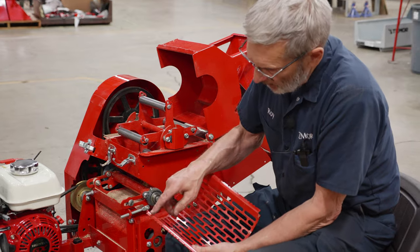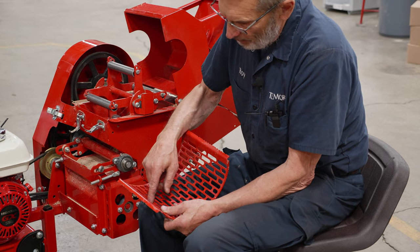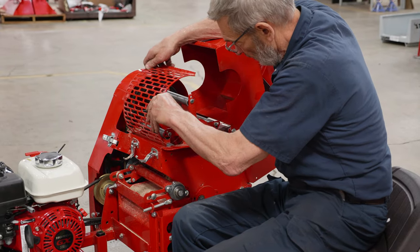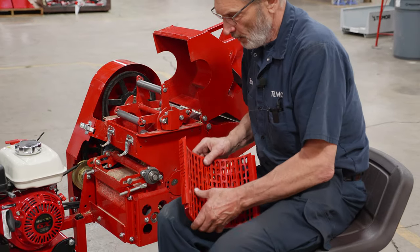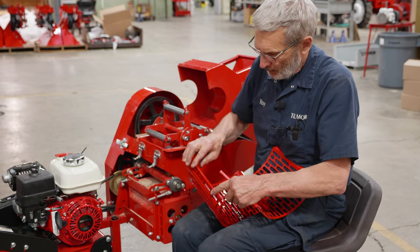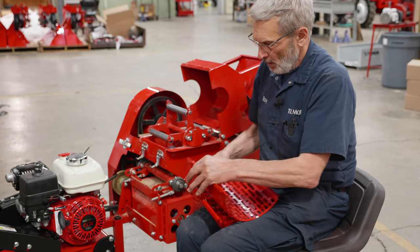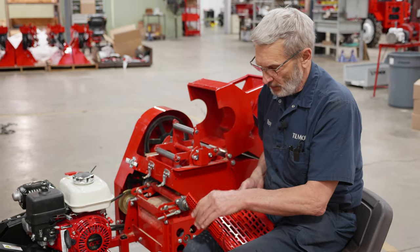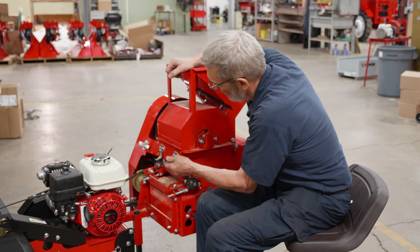This screen has a code on it. There are five notches and five notches in one — that means 10 plus 1, so that's an 11-millimeter opening. That's the size I have in right now. With this machine you'll receive four more screens. Looking at the opening: this one has 12 notches, so it's 12-millimeter spacing; this one is 10 notches, 10-millimeter spacing; then 9-millimeter and 8-millimeter. So you can slip in the one that works best. They go in either direction — it doesn't matter which way, they're notched on both sides. Once that's in you can close and latch it tight.